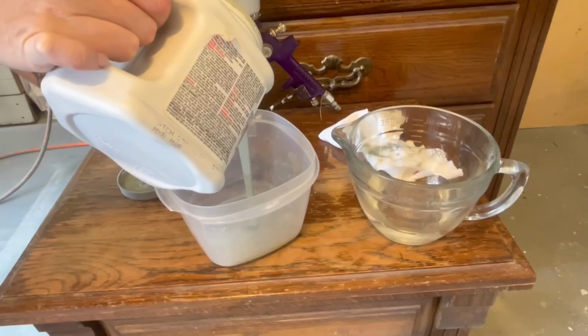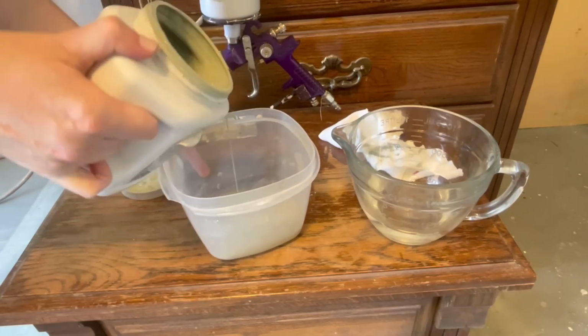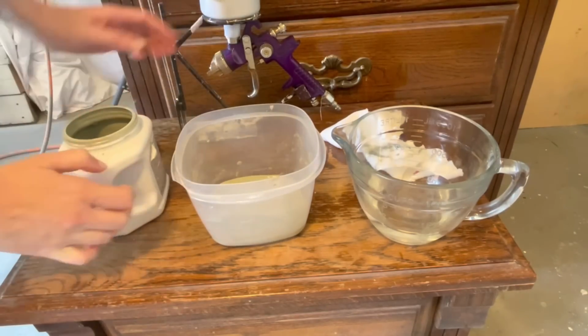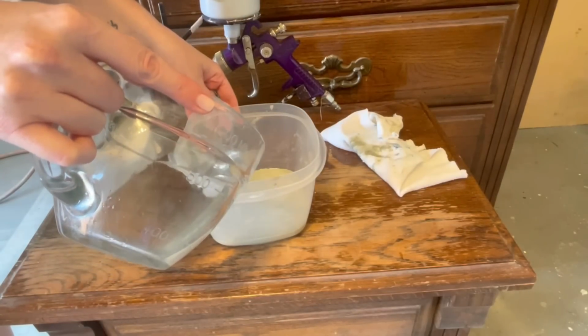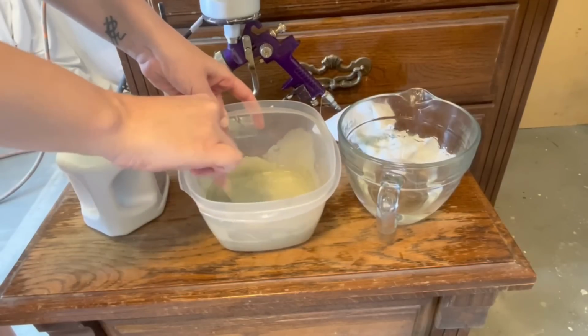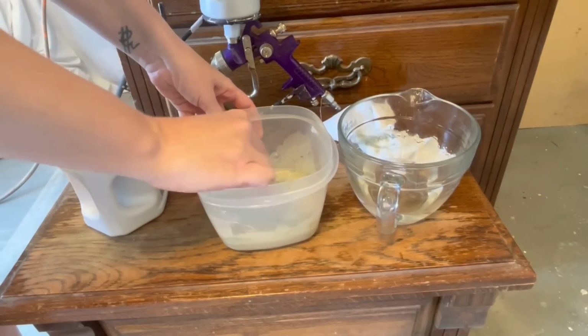For the drawer fronts, I decided to go with a paint wash. I used equal parts Evergreen Fog to water. I wanted a little bit of that wood grain to show through to tie together the really cool detail we're about to add to this dresser. Stay tuned.